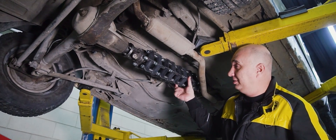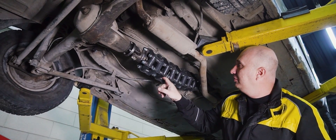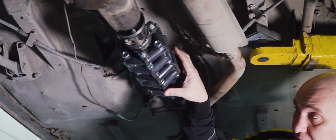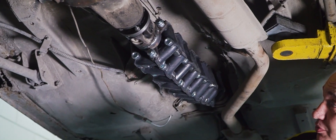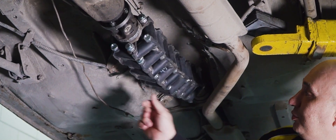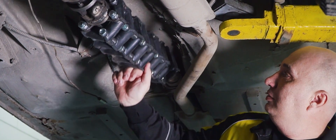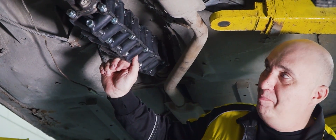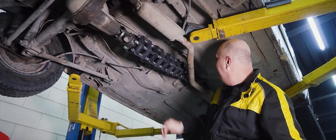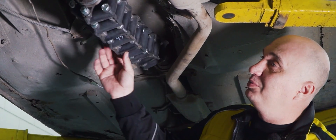This is what we're looking at — a wonderful elastic propeller shaft. We had to use collars to piece all of this together, otherwise the bolt heads wouldn't clear each other. Without them, this would have been all crooked after tightening all of the fasteners. But as we are, it's all looking very good. After we installed it, check this out — it truly is elastic. That is the entire point of a coupling, so of course the prop shaft is going to be elastic. We've welded on the adapters, so that's good.